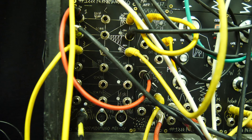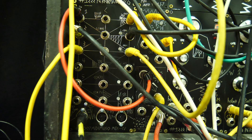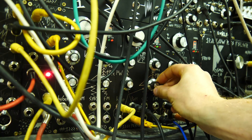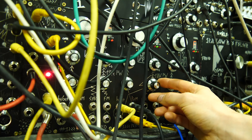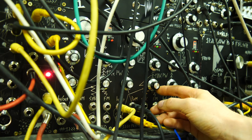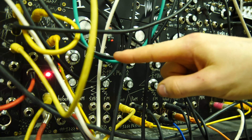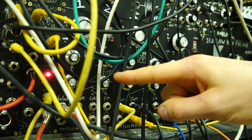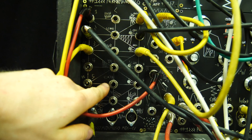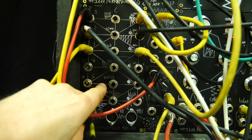It plays perfectly fine. You could plug a MIDI keyboard with pitch bend straight in and get that coming out into something like a CV input of an oscillator, then use a CV attenuator to judge the range of the pitch bend. The whole pitch bend range is five octaves maximum, ending at 2.5 octaves in the middle, going to minus 2.5 or plus 2.5 depending on direction.